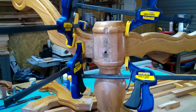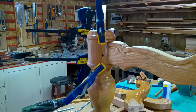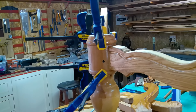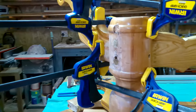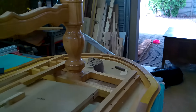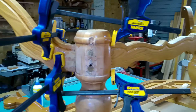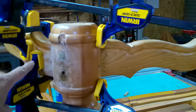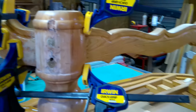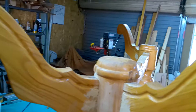So guys, with this elaborate clamp setup I've now clamped my leg where I want it, making sure that the line of the leg lines up exactly. My major point is to make sure the top of this leg to the base of the top is the same as the other leg on the other side. It's clamped down now — I'm going to put my drill through the hole I drilled to mark on my leg where I want to drill to accept the coach bolt, which is 180 millimeters long. The coach bolts are now in and they are actually quite plenty strong.